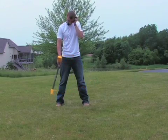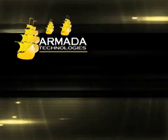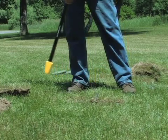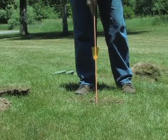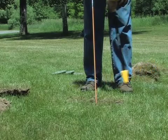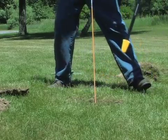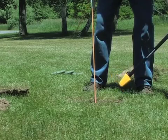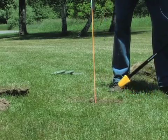Peak means the opposite — that the signal is loudest over the cable. You may select which mode suits you best. You can also find the approximate depth of the wire. First, trace the path of the wire. Then step to the left or right of the wire path and hold the receiver at a 45-degree angle pointing towards the wire. Find the angle that produces the null signal and use that angle along with the wire position to triangulate an approximate depth.